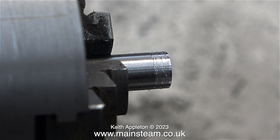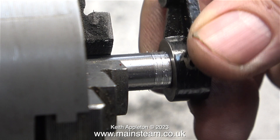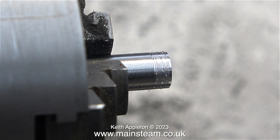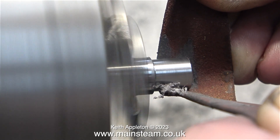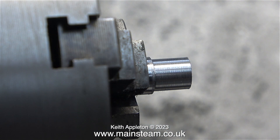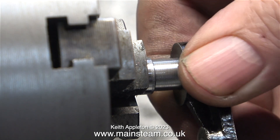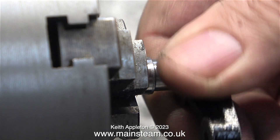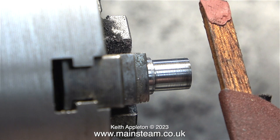Currently it's 7/16 of an inch in diameter and I need to turn this down to 3/8 of an inch. I'm not going to use a micrometer for this job — I'll just do lots of test fits. I've skipped over a lot of the turning because it does get a bit tedious. I would like to mention at this stage that I do not want a mirror finish on this part. This original newly reamed crank web needs to be a very tight push fit onto this part. I started off using some emery cloth but really I need to do it with a piece of wood to keep it flat.